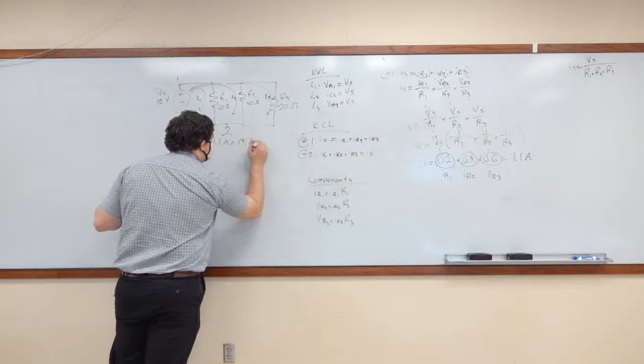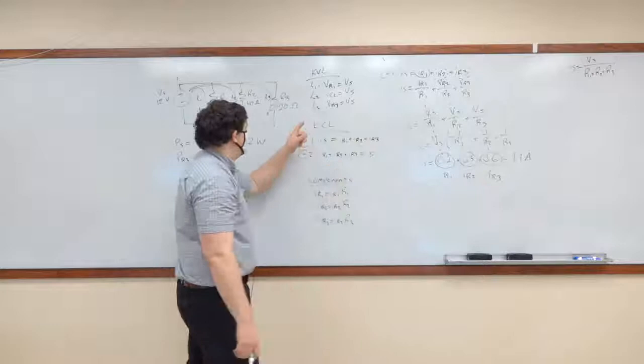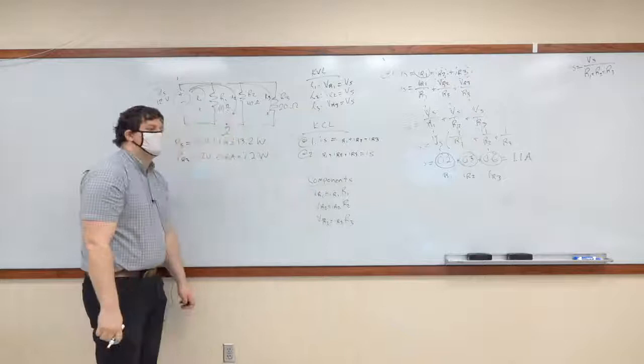Okay, PR3, that is going to be, we have IR3, which is 0.6. We have VR3, which is 12. So we have 12 volts times 0.6 amps is equal to 7.2 watts, thank you. Did you do that in your head? Okay, thank you. See, she knows how to do it right.